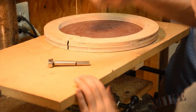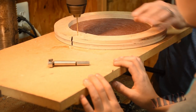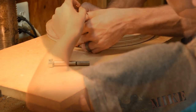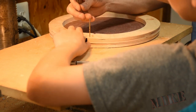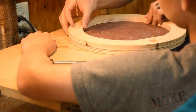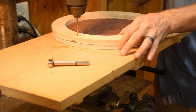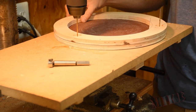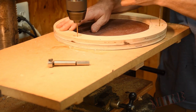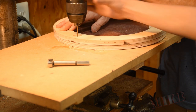Now we're going to use a trick where we sink this drill bit back into that hole to use the first hole to locate the next hole. This is the sander platen from my sander — it's a defective one so it's got a sandpaper surface. We're going to leave that drill bit in there and get two more small ones so these don't come out of alignment. I always leave drill bits in things to help align them because it's super simple. Now we drill the second hole — we're going all the way through — and that'll locate that hole. Then we'll come back with the Forstner bit and finish it out, stopping the drill in the wood and releasing it so it stays aligned.